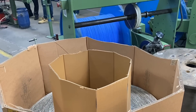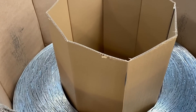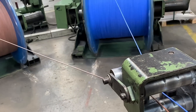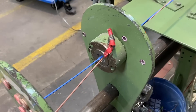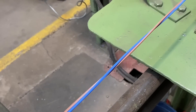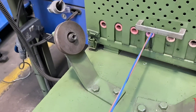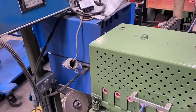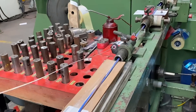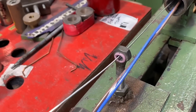The bare earth wire used is a tinned copper circuit protective conductor. These cores are then twisted together — the twist coming from the bow inside the machine, which you can see travelling out towards the conductors. As the conductors come through, they go through a high-voltage spark tester again to further check for insulation defects, and then a tape is added around the cores to aid in strippability.